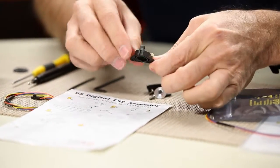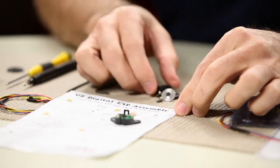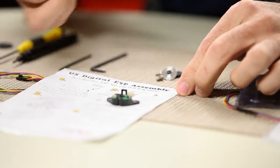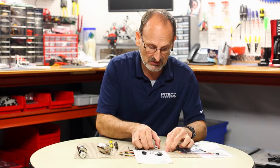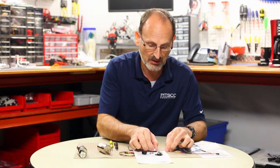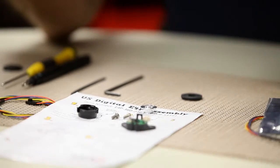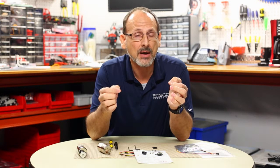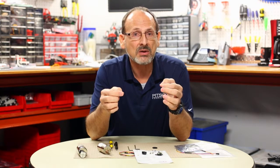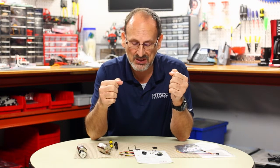The kit includes a base that mounts to the motor, a cap, two mounting screws, and the actual optical disc itself. I want to caution everybody here — you want to make sure that you have very clean hands or you use gloves. The oil from your skin or any dirt, if you get that on the optical disc or reflective disc, can actually deter the performance and make your encoder not as effective, or prevent it from working at all.